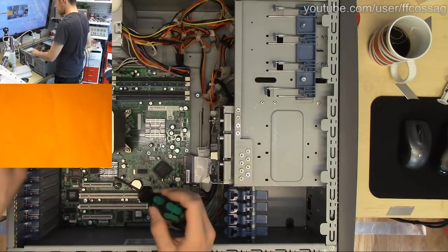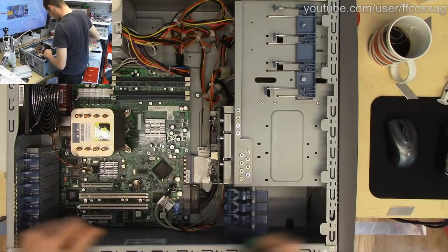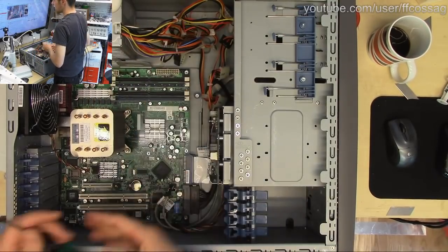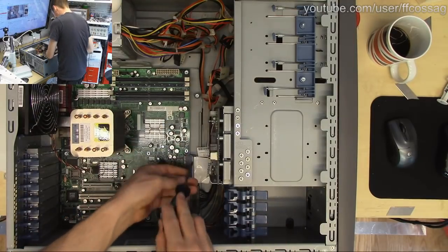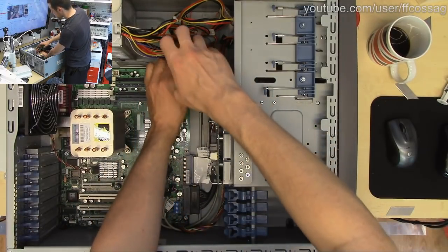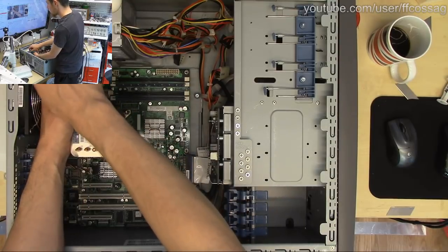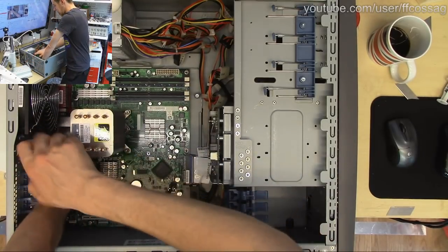Normally I wouldn't actually put any amount of effort into a server this old. We don't need a microscope for this. That's better. There's a machine that I'm going to be working on that's currently a 2008 HP workstation with real consumer grade hardware in it that's been acting as a file server since it was new. This thing is a bit older than the machine it's going to be replacing, but it actually has ECC DDR2 on it, and it's actually server grade hardware. So I think it's going to be better. Also, this has been out of commission for a few years, whereas the 2008 machine it's going to be replacing is still running and serving clients right now.